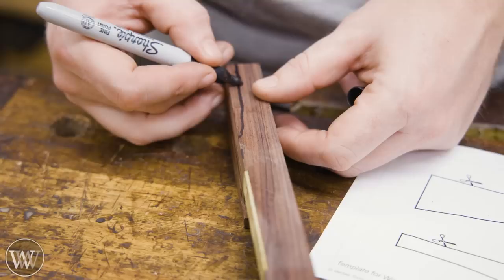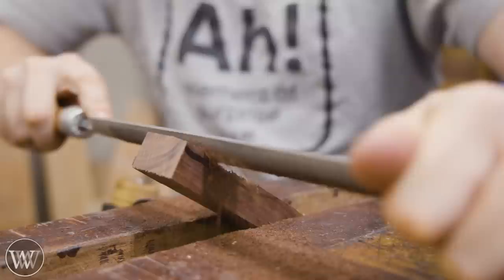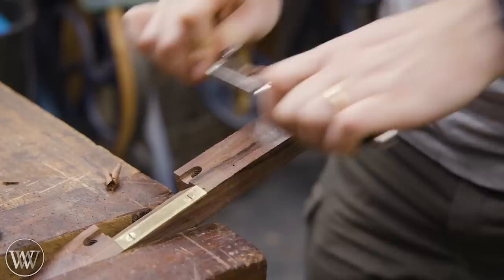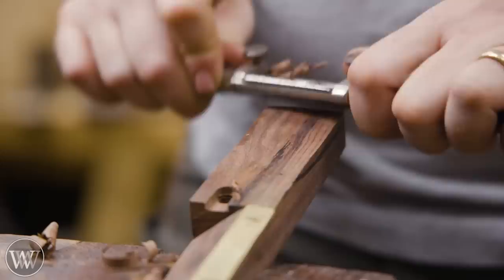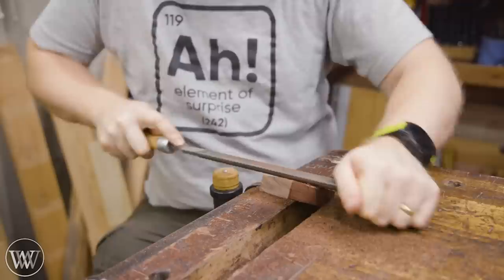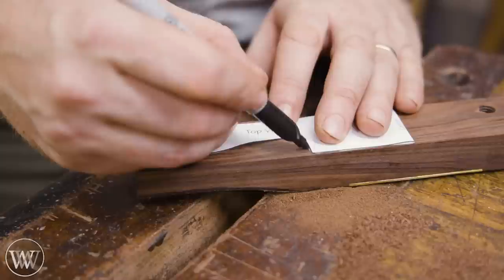At this point it's basically functional, but we want to make it look pretty. A lot of this you could shape by hand and eye, but the plans come with a set of designs you can sculpt from. Some of these I did by eye, some I followed the plans. People ask why I don't use a spokeshave to make the handles — I really don't like using a spokeshave to make a spokeshave — but for shorter sections I'll do it both directions. Anything shorter than about four inches, a rasp takes about the same time. A spokeshave gives you a cleaner surface immediately, but with a rasp I have to follow up with a file.